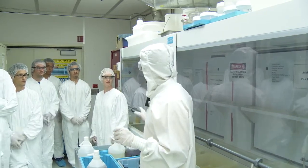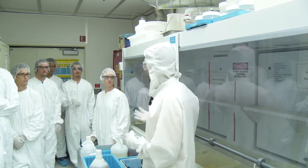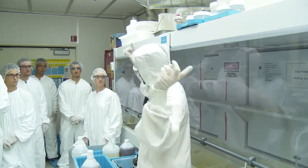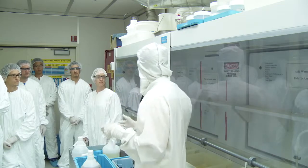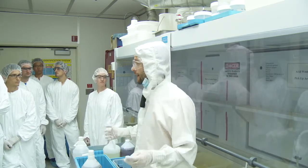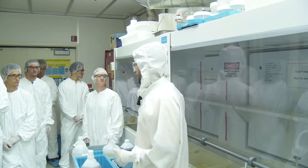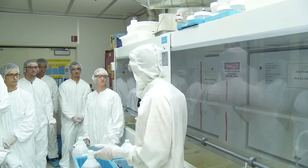And I told you at the very beginning that we have the other room that is the bion. The bion is for very harsh chemical processes like wet etching, where you use HF, hydrofluoric acid, which is pretty dangerous and pretty scary. So all the wet processing is in the other room. Here we use machines, so you will see them, and also photolithography. That's the only kind of wet process that you can use here, and cleaning with acetone and IPA, so with solvents. Everything else that is wet processing is in the other room. So that's it, I only wanted to show you that. If we were in the other room, we would maybe explain how scary certain products that we use are. But if you are interested, we can talk later.